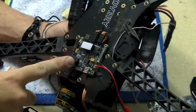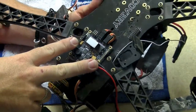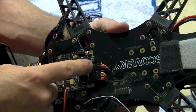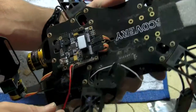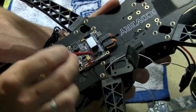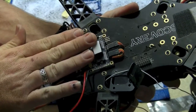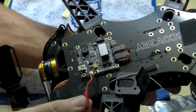I've gone ahead and put my board on the machine now. I've just put the pads underneath and mounted it up front here in between all the screws so I can still get to all of them. For those that want to know — looking down the board — pitch is in the middle, roll is on the right. Roll is closest to the battery terminals. We supply one of these power leads with the kit. If you want to plug and unplug it, that's fine. If you want to hardwire it in, if you chop the end of this plug, it is long enough to reach the positive and negative terminals on the bottom plate of the Discovery if you mount your board here. If you mount it further back, you'll be able to reach the ones on either side depending on your orientation.